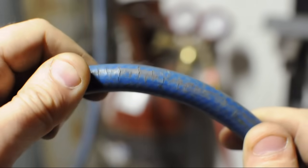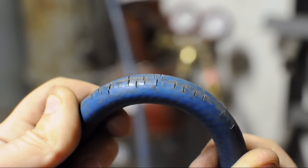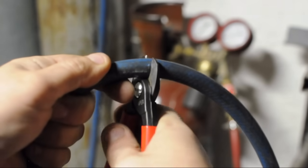I discovered a leak in my oxyacetylene lines that I think I just fixed. The oxy line was pretty bad, but the acetylene also had a small leak that took some soapy water to find that one.